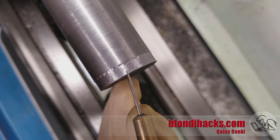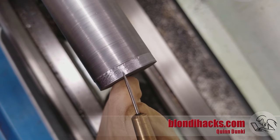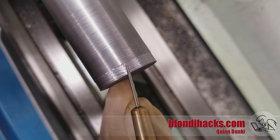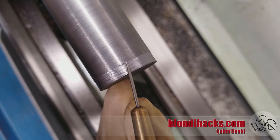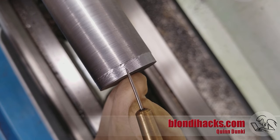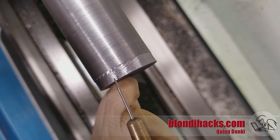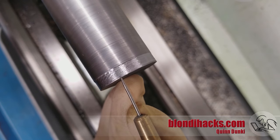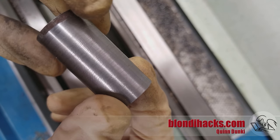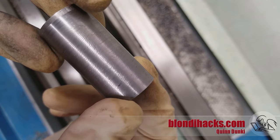Here's what it looks like on the material. You can see these kinds of scallops and angled, regular striations — sometimes a diamond pattern — and it's really the same thing that was happening in the butter. That tool bit is catching and releasing, and it keeps catching in the same places every time. Which is important when you go to remove chatter marks: you have to make sure you do a pass that's deeper than the whole chatter area, otherwise the tool bit is just gonna fall into those same cracks. Here's a finer pattern that you might more typically see in a less dramatic case — again, those diagonal or diamond-shaped striations in the material.